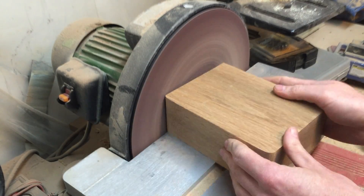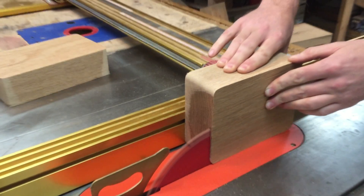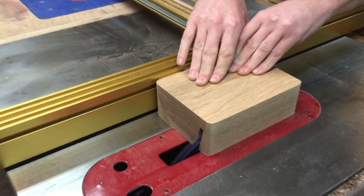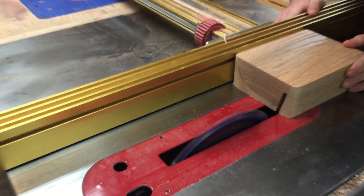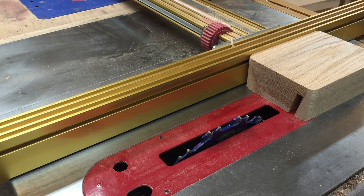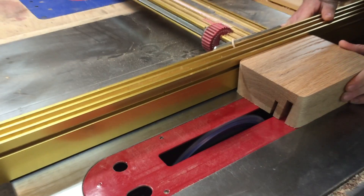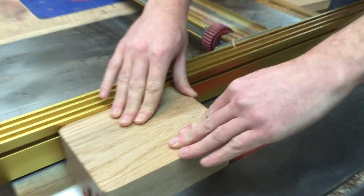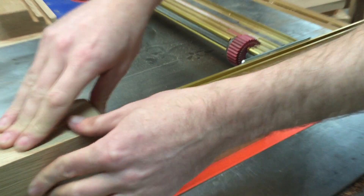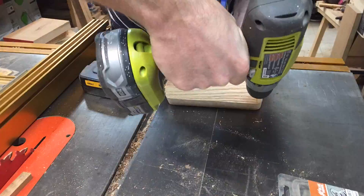The first thing I'm going to do is take my chunk of wood and round over all the corners on my disc sander. Next step is to cut off the bottom. I'm using my dado blade tilted to 10 degrees to start cutting out the area where the phones are going to sit. The front dado is cut deeper than the back dado to create a two-tiered effect, so the phones in the back will sit higher than the ones in the front. Then we'll switch back to our regular blade and cut those off so we'll be able to see the phones when it's in the dock.